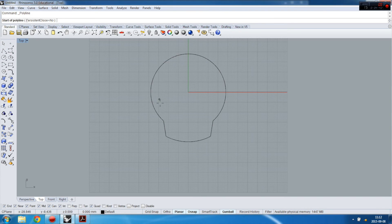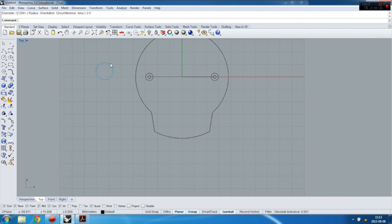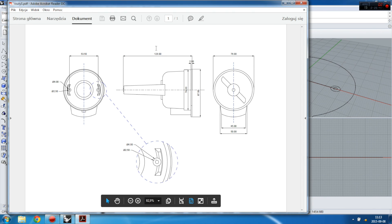I need to find the line between the centers of these holes, which is 53.5mm. I align them to my center at the zero point — typing zero here will automatically align the center. I've got the first circle with a diameter of 6mm, and then 2.5mm, which is the screw dimension. These are two very important dimensions. Now I have to move these by the correct offset.